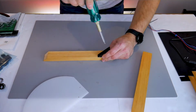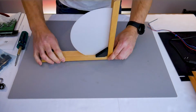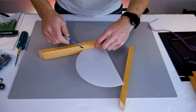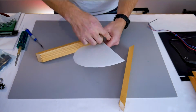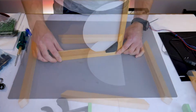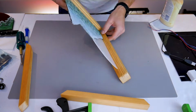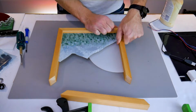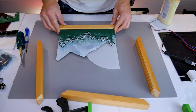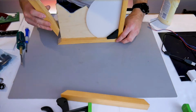One thing I want to point out while you're watching this sped up version of the assembly is that this white piece here, which is meant to represent the sun, is currently made out of this white piece of acrylic. In my original 3D rendering, I actually wanted to make this out of red acrylic. With blue diode lasers like the one on the Laser Master 3, typically you're going to be able to cut darker acrylics like black or perhaps even a dark red. I had intended on trying out a translucent dark red acrylic on the Laser Master 3, but I ultimately decided to go with this milky white acrylic because when I was playing around with those NeoPixel RGB LEDs, when shining through the red acrylic, it really messed up the way the colors looked and I wasn't really happy with it.